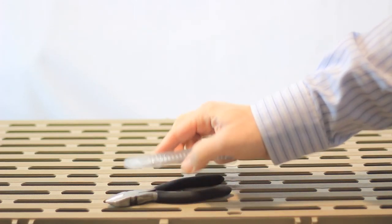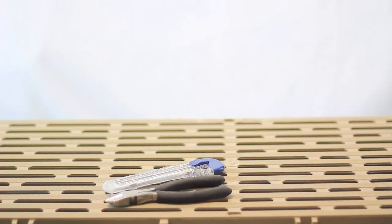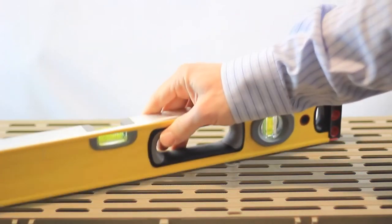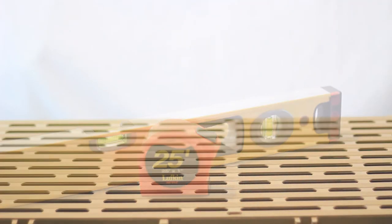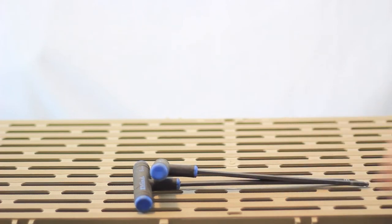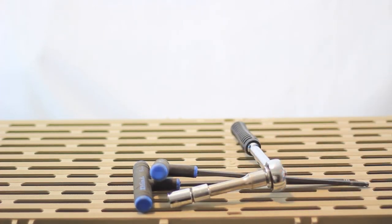I always like to have a couple of tools handy to deal with packaging — in this case a knife and a set of side cutters. All ramp construction projects, you'll need a level and a tape measure. For all connections on the Q-Ramp system, you'll need either a 5 or 6 millimeter Allen wrench or a 13 millimeter ratchet. We recommend long-handled tools for ease of use and to keep your knuckles away from edges.